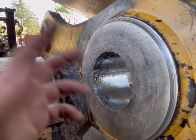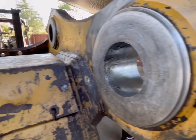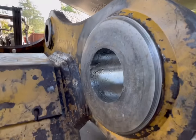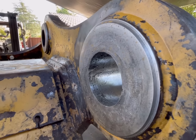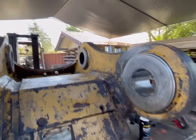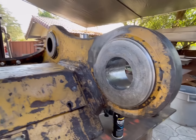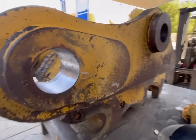When you're cutting now, it's definitely possible that your insert will hit that and it will break, but that's just part of the job. It's a lot easier to get it out that way versus having a hardened weld in there, which I have made that mistake before welding on some cast and other stuff, and it's like machining glass. Basically, you ruin the part. So, there you go.